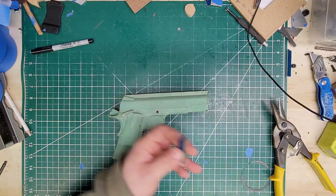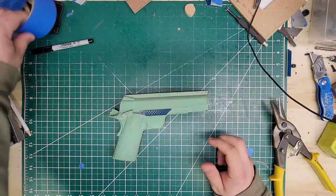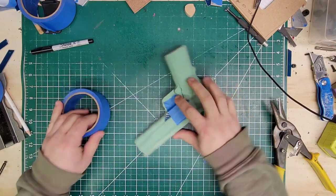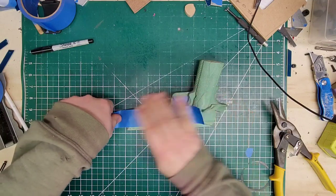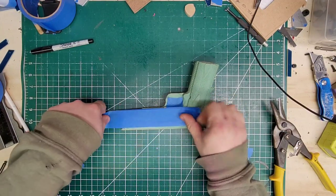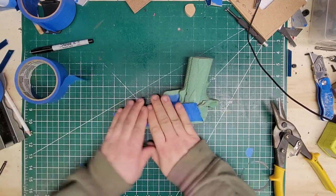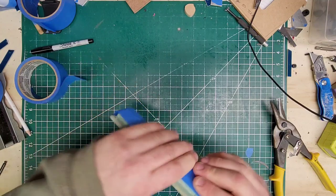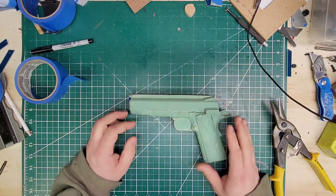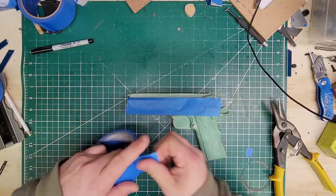So I'm going to go sand this real quick — that's literally all this is. Mark that down. Fits perfectly. I'll just take an itty bitty piece of tape and throw that in there and tape this guy. I just did eight layers. Reason being, I'm pretty sure this mold is slightly thinner than it should be. I think over time your press just wears them out, but I think this has been tight from the beginning. So I'm going to throw an extra couple of layers on there.